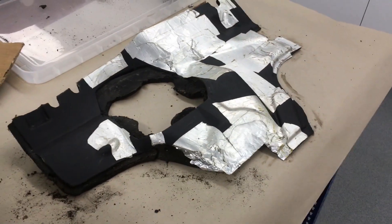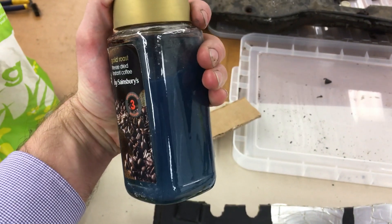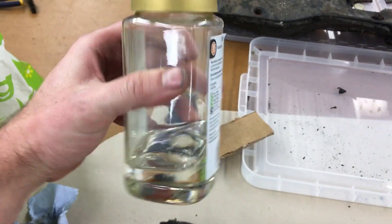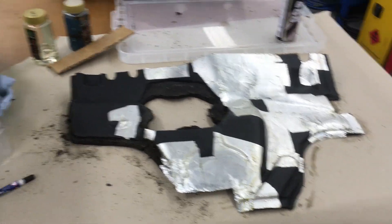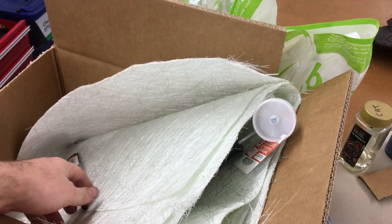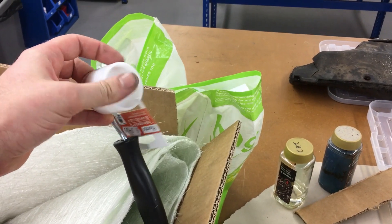Alan, who's really good at this sort of stuff, and I'm going to do what he's told me. Here I have my Gold Rose fiberglass resin and my catalyst — which is also a type of coffee, interestingly. Going to mix those up and then lay on my chop strand, work it in with a roller and a brush. That's not a proper fiberglassing roller by the way — that is literally just something I bought in the DIY shop.